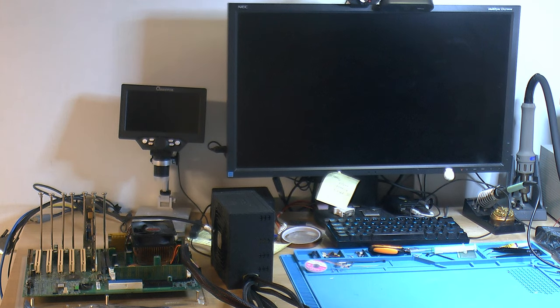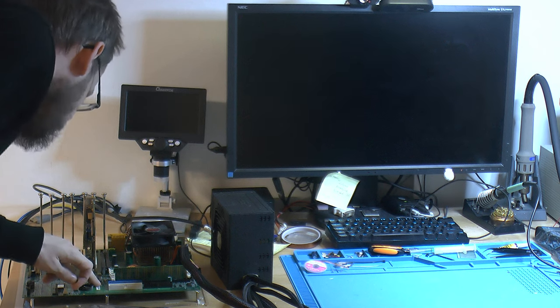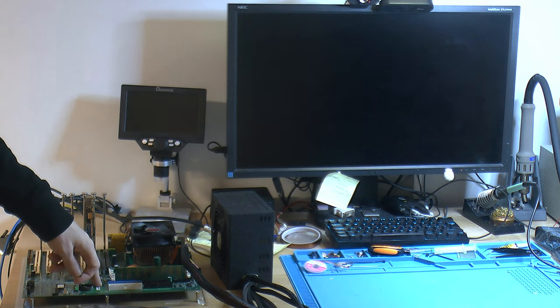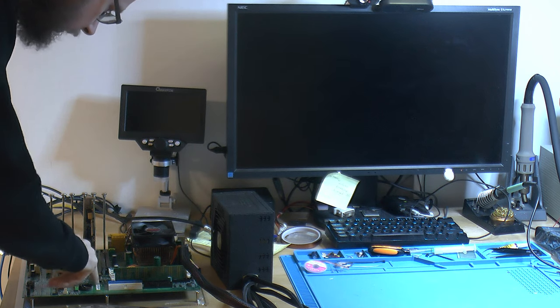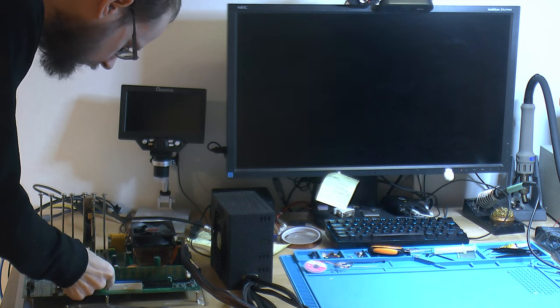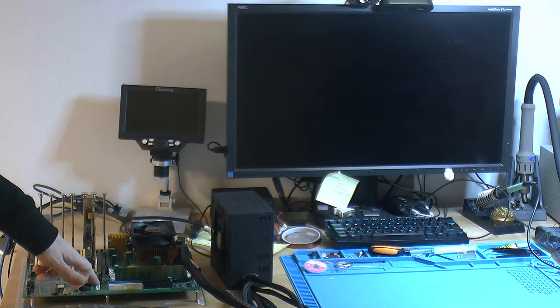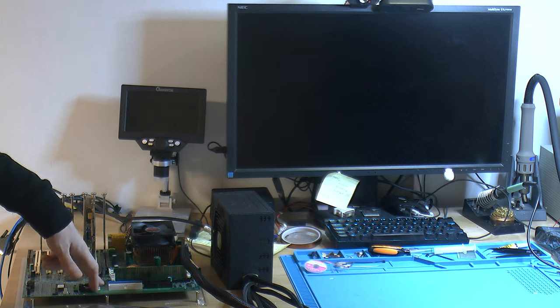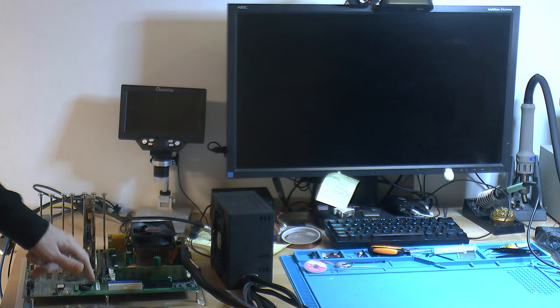What I suspect is going on is that there's a jumper here on the motherboard called, I think it's J17. Now I did download the manuals for the board, but that one wasn't in there. That's kind of annoying. But I think that jumper is for selecting between 100 and 133 bus. I think, because I had a board and I told the owner to put it down to 100 bus because I'm testing with Durons, and he didn't. So I got stuck at 133 bus and tried to basically overclock the Duron to hell. So I think that's it. I'm going to put a jumper there. I think it's going to post.